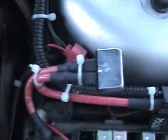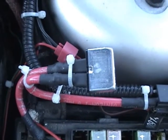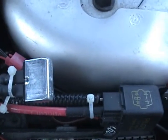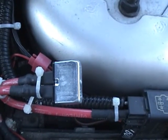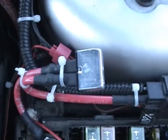I wanted to go over the circuit breaker. If the unit draws more than 30 amps, the circuit breaker will kick off. It will kick back on automatically when it cools down. This is put in place of a fuse that you normally have to replace if you went over 30 amps.